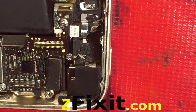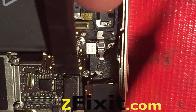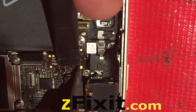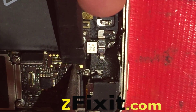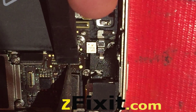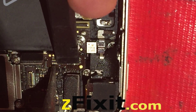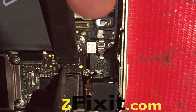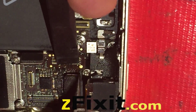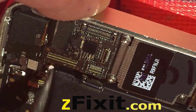I don't show how to solder around the chips. As you can see, I'm avoiding the chips — it's a different technique for getting a soldering iron to solder those particular points near those two chips. You have to be very careful not to touch them. If those things get removed, you are just SOL, so don't touch them. I do put additional solder on the soldering iron off-camera and it flows into the solder pads.